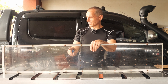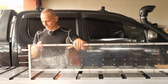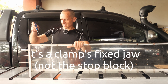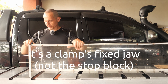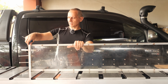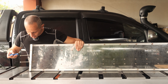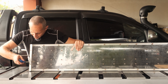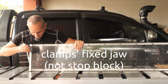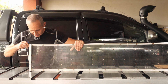I can design all my attachments and jigs to use four or two inch distances between the mounting holes and attach anything I want to this sled. The first good example of such an attachment is the stop block. For the stop block I used a three-quarter inch square aluminum block, drilled the holes six inches apart, and simply screwed this aluminum stop block to two of the matrix threaded insert holes.